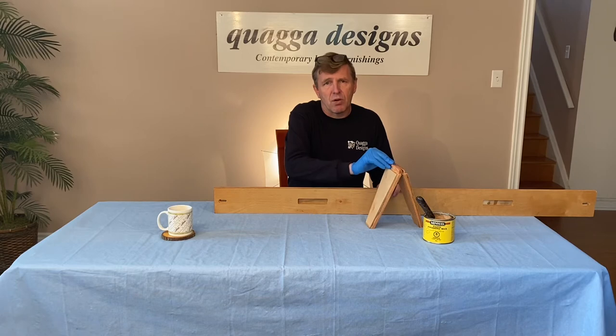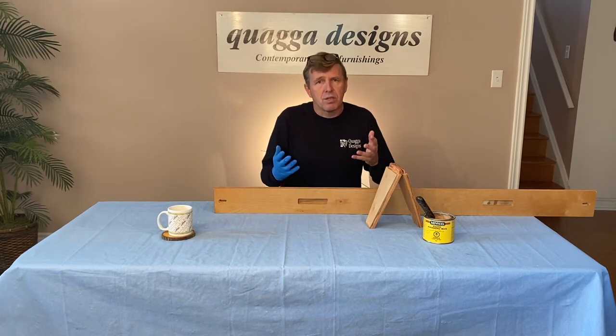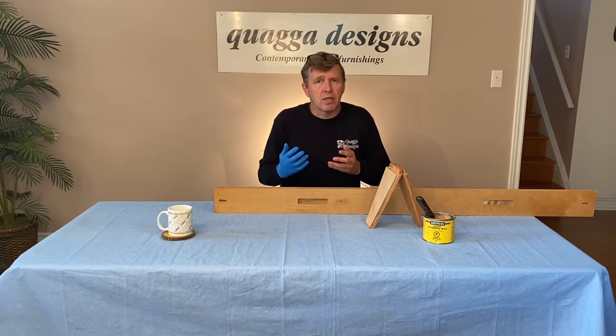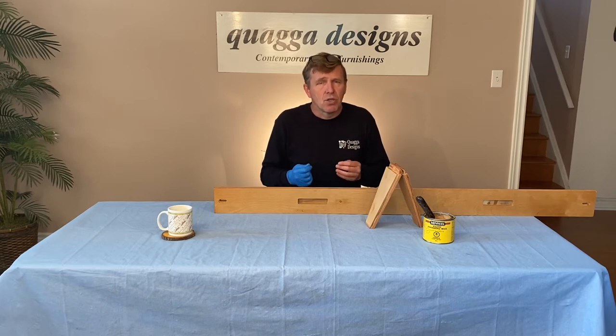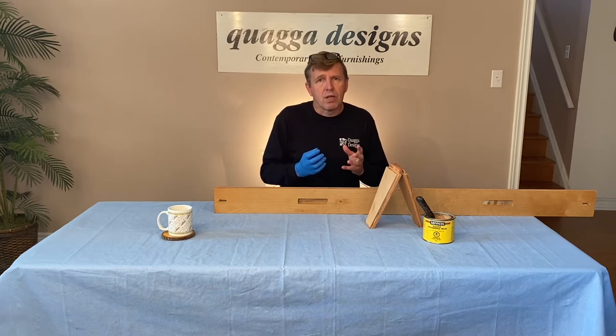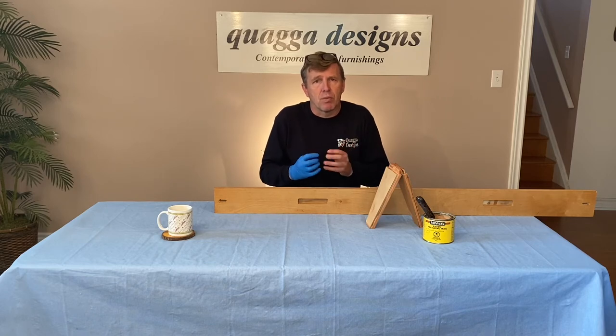So when the wood dries out, and it does tend to dry out over time, different seasons, hot during the summer, hot and humid, and drier with the heating going, it's a dry heat, so it dries it out. It's just like hardwood flooring. The gaps widen as they dry out during the winter, and they close during the summer when it's really hot and humid.